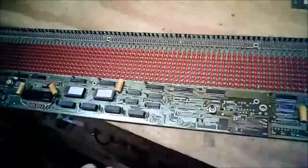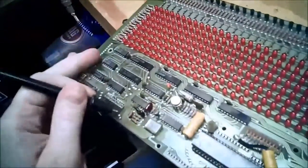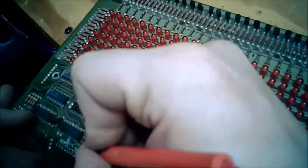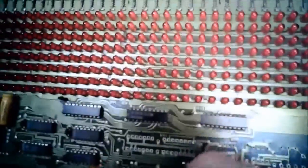So the net, I think, comes in. It was pin 2 on here, and I think it's one of these two. That pin right there, which then comes into that connector. Okay, so this pin's a don't care. He went to the keyboard, so he's part of the keyboard multiplex, demultiplex logic somehow. In fact, I don't have a keyboard, never will have a keyboard. He can just get punted.